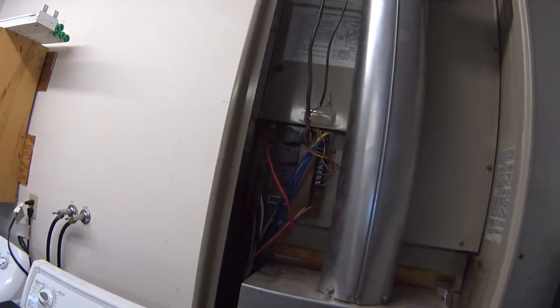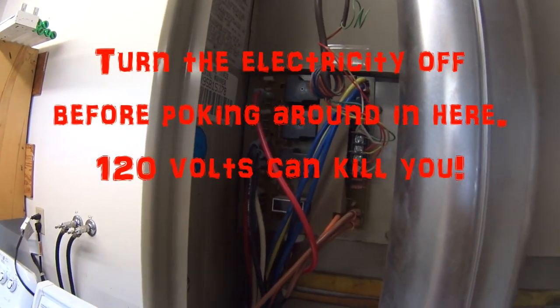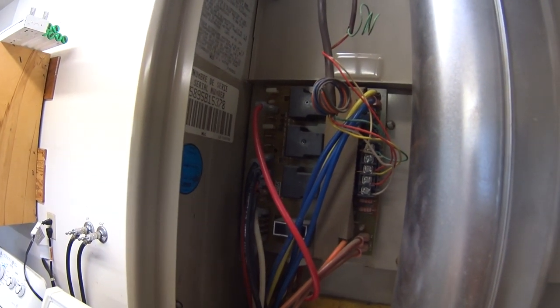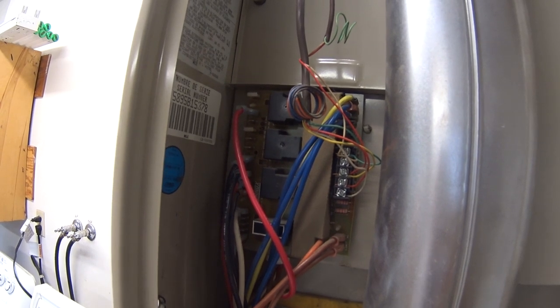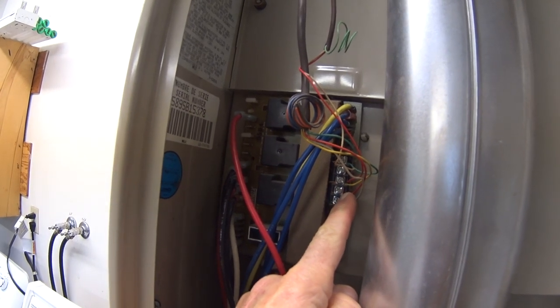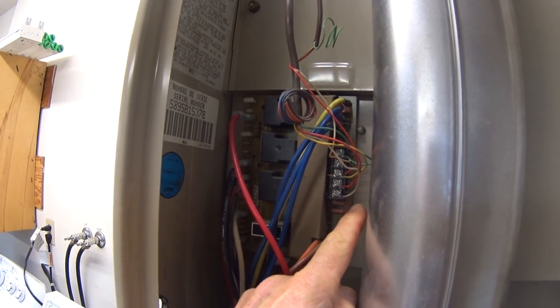So that part is all fixed, but what's happening is the blower is not coming on still. So I think the problem with that is this unit right here, which is the blower control, and that's a Lennox BCC2-4 unit. The way this works is these connections go to the thermostat. When you turn the thermostat to heat and it starts calling for heat, these last two terminals here connect at the thermostat. So there's continuity between the two of them, and that is terminal R and W.